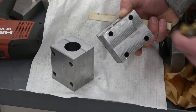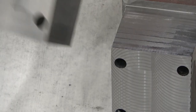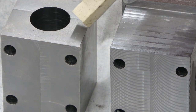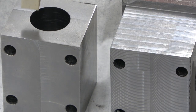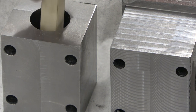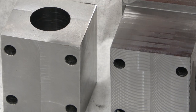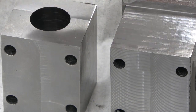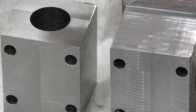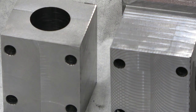So I eased back on that, and instead of doing, well, let's zoom right in here. There's the surface finish on the second attempt. We come in here, faced off the top lengthwise, and then spotted and drilled a through hole, half inch, in order to allow for the center of the tool, that high feed mill doesn't cut. So we had to get rid of that material. Otherwise, it would have cut if we had a bigger circle, but we were only moving an eighth of an inch. So we didn't have that much.